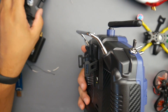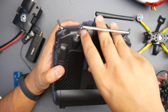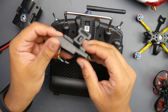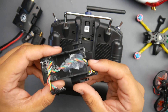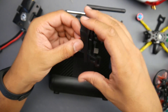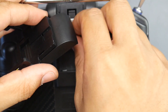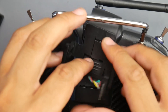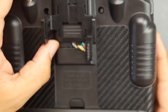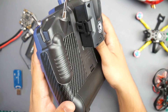For the TBS Crossfire with any full-fledged size module, here's my mod. I took the cover that it comes with and purchased one of those X-Lite adapters. The X-Lite adapters won't fit because of the way the sides are, so I just used a bit of hot glue — hot glued it onto the default back cover, made a little square hole to bring the wires through, and put hot glue over everything to hold it in place. Whenever I want to use the Crossfire, I just plug it in. Most of the wires go to the right side. Nothing is being squished — there's still a lot of room. Just bring in any full-fledged module and you have a nice-looking setup.